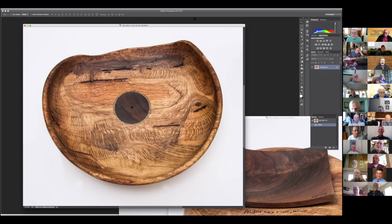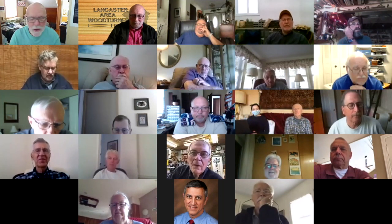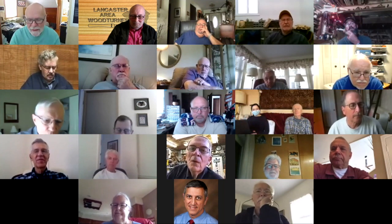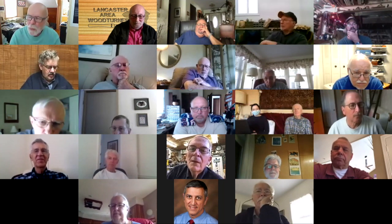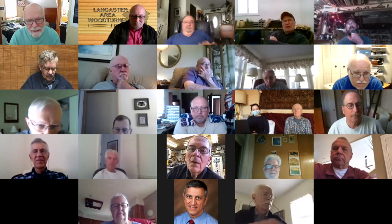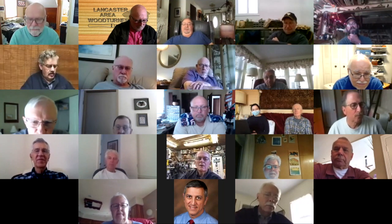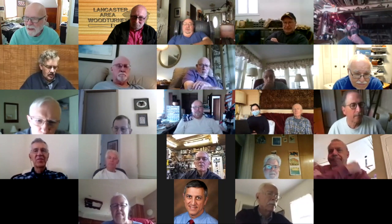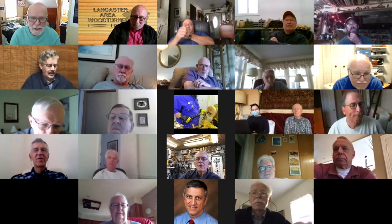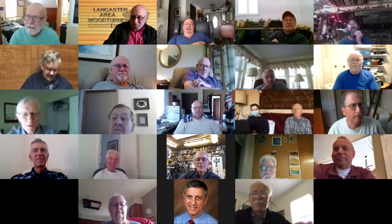So for most of the root I've seen, you really get some fantastic grain in it. Yeah, I have become hooked on roots now. It's a little weird to grab them and turn them because they're odd shaped, but that's the fun of it. So that's what I've been doing. Well, the roots are under a lot of stress, so they get twisty. And the other thing I learned is they can have a buried stone right in the crevice that you thought was clean until your chisel hits it, and boom, you're back to the grinding machine. So been there, done that.